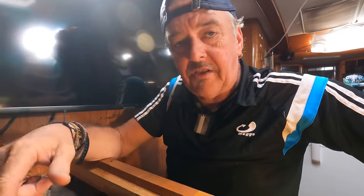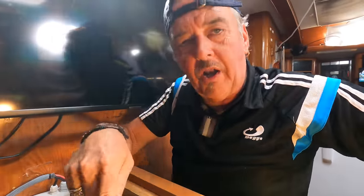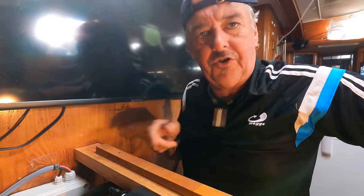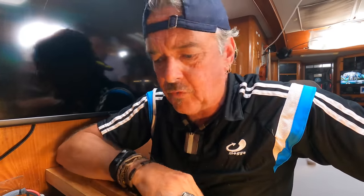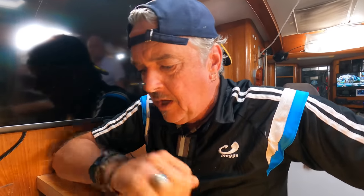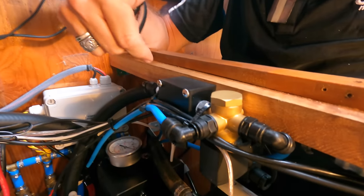This device right here is another electronic sensor — a bypass device. If the water quality the system is producing is not up to quality, if it's too high in total dissolved solids, the electronic sensor will automatically activate this solenoid and cause the product water to discharge back to the brine discharge and go straight out the back of the boat. It's a nice feature so you don't contaminate your tanks with the first one or two minutes of water when quality isn't high — the system always starts lower quality and improves as it runs.